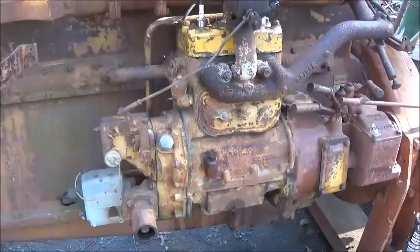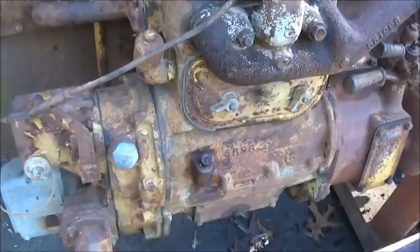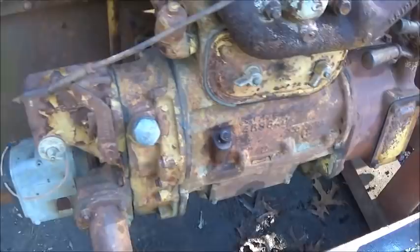All right. Okay, folks, power unit's back on. Getting ready to put some water through the water hose into the block and just go ahead and make sure that we don't have any leaks. I'm going to leave the drain plugs out of the block, make sure there's no water coming in there, and we'll know real quick if there's a crack somewhere that we don't know about.